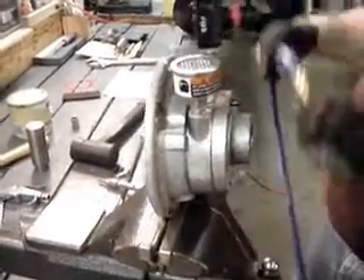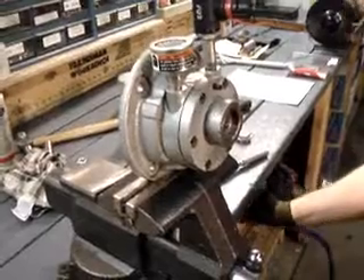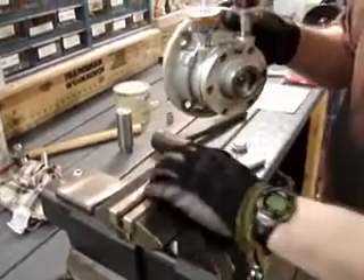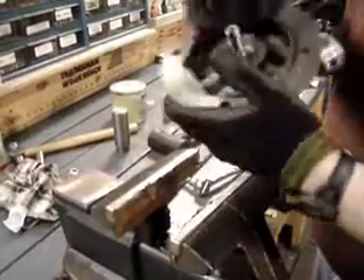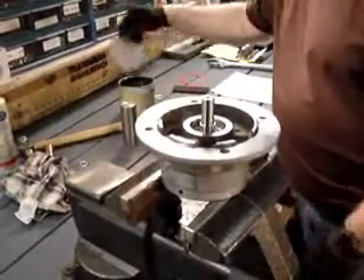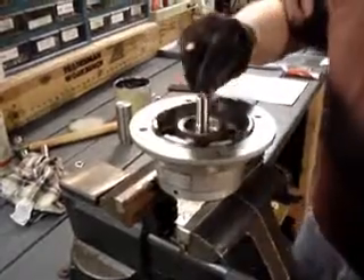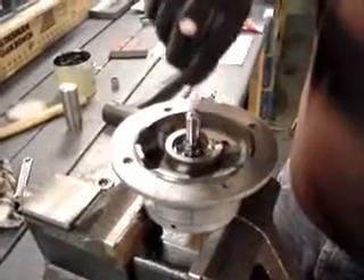Now we're going to disconnect the air. We're going to take and put the motor upside down in the vise to do our drive-in bearing seal — that's this item here. But before we do that, I'm using a lithium grease here; you can use an all-purpose grease or a silicone grease. Just swap some grease around the bottom of that rotor assembly, right above the bearing.